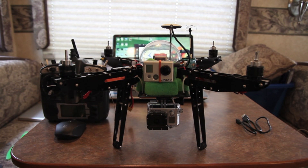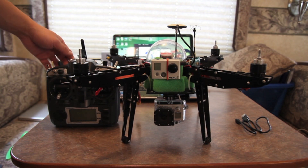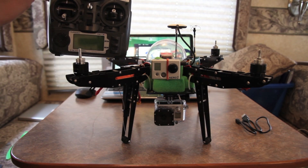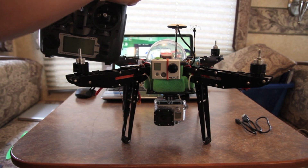This is Dartmouth-01 and I'm creating this video to show you a few things I've learned about ATTI and manual gains on the Naza M. What we're going to do is connect the White Spy Quad to the DJI Naza Assistant so that we can change some settings to allow me to change the gains in flight using these dials on this controller.